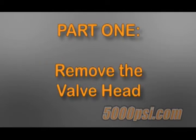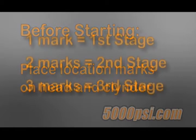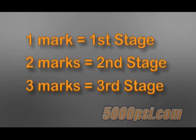Remove the valve head. Before you start the project, we suggest placing location marks on head and cylinder. This can be done by using a center punch and making matching peen marks on each component. Make a single mark on the first stage components, 2 marks on second stage, 3 on third, and so forth. When reassembling, simply realign the marks.